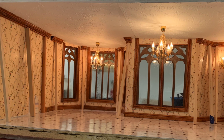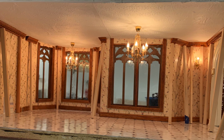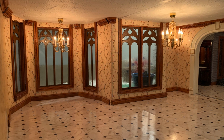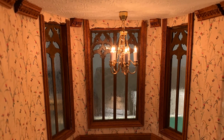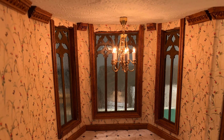Ceiling paper was installed and resin-stained crown molding was glued in place and propped up with wooden supports. These were tricky cuts. Since the top of the windows are so close to the ceiling, we didn't put crown molding above the windows or top window trim. Like in the dining room, we are hoping that the curtains will conceal that there is no crown above the windows.